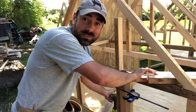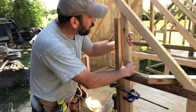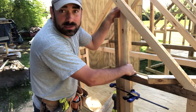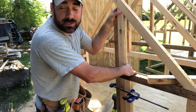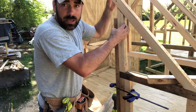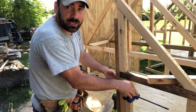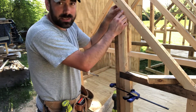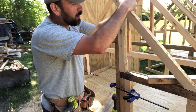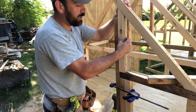I've got some of these pieces scribed and cut out - this is my right side and my left side. Look at that, it fits in there perfect. Now I need to secure this. I don't want to accidentally push this away - I want this piece that's clamped in here to stay straight and hold this in. I'm going to be putting in a couple screws from this edge, from the rafter, to hang on to it here.